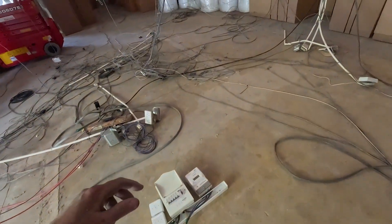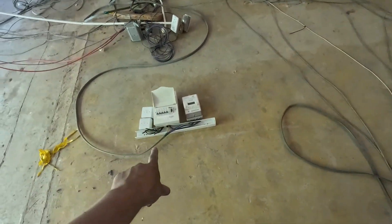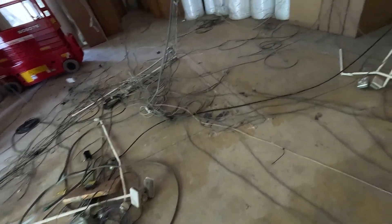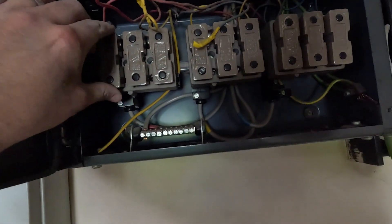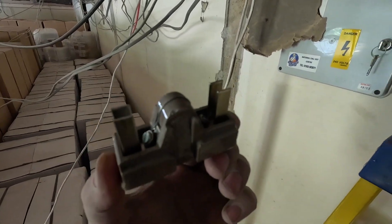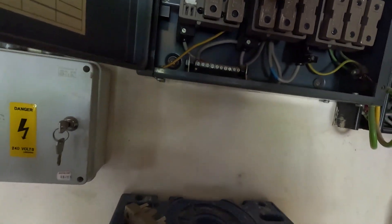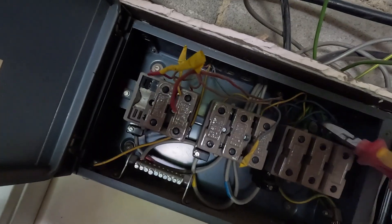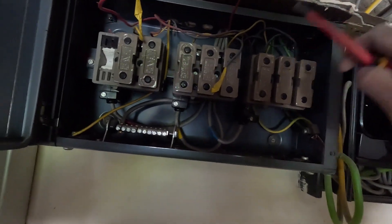All right then, look at me - I'm black. Nice to get cleaned up. So what we've done is disconnected most of this stuff. We've got one board over there - all the outgoings are disconnected. This board here, all the outgoings are disconnected. So we've got a little armoured cable now that goes over here, and what that's doing is it goes into this old rewireable fuse board. So we'll just disconnect that. That's an old rewireable fuse - it's fuse wire, so that melts essentially and that's what disconnects the circuit. And that's asbestos, so you've got to be super careful.